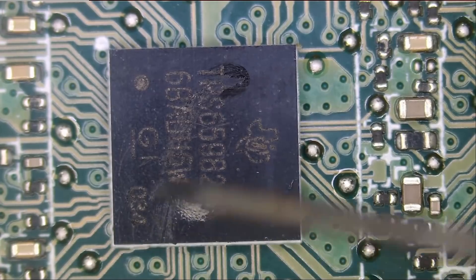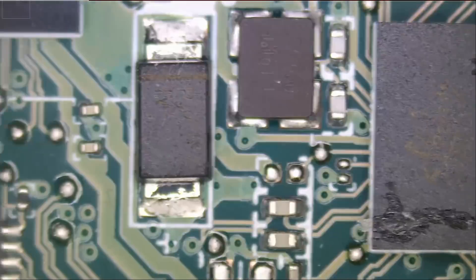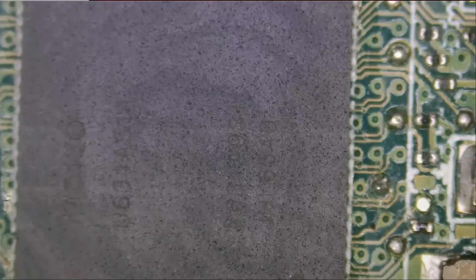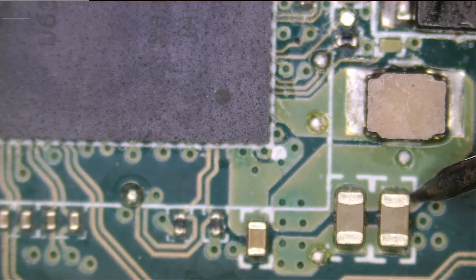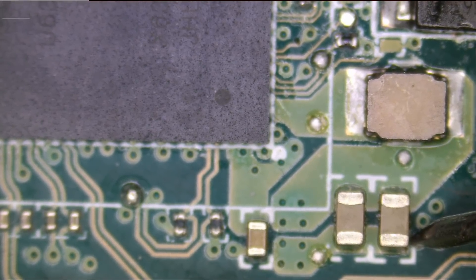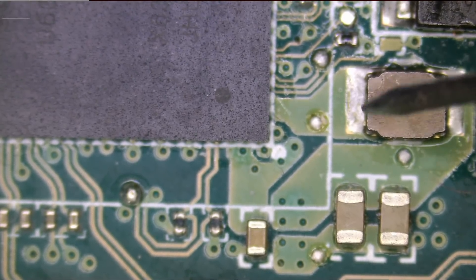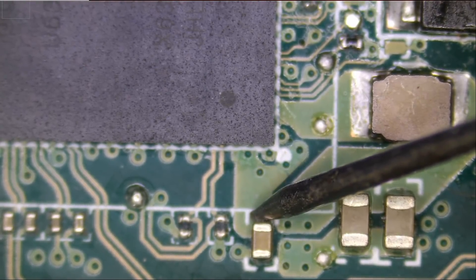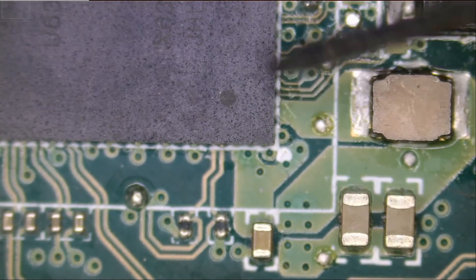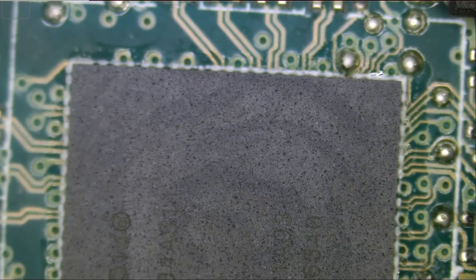If this chip is bad, it's very likely that the fault spread over to that chip also. What about this one here? Let me test capacitors at random just to see if we have a short anywhere. And we do have a short. This pad is going through this inductor onto the chip. What about this capacitor? No short here — it's going to a separate part of the chip. So this part of the chip is shorting to ground, which means we have to replace the big chip.